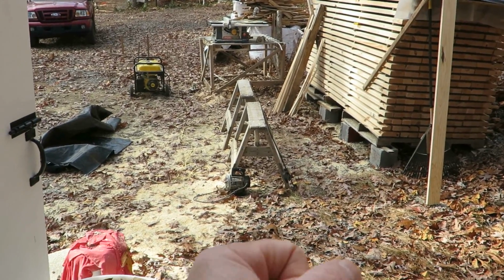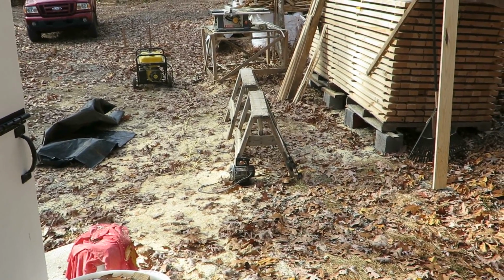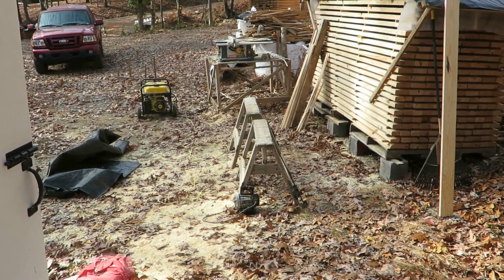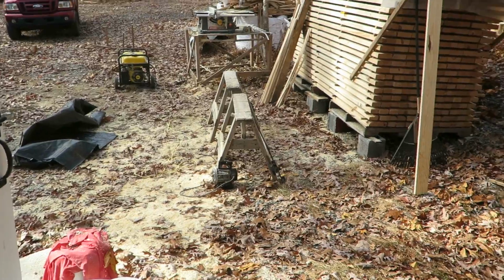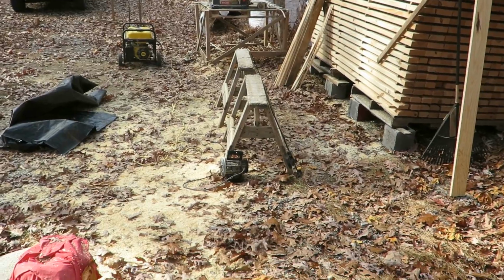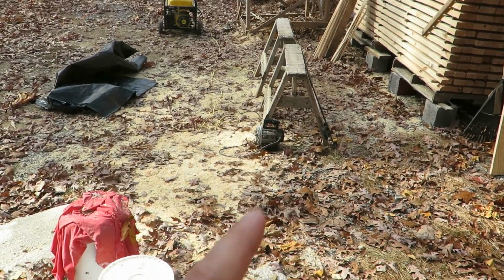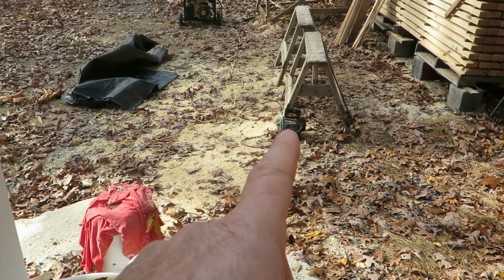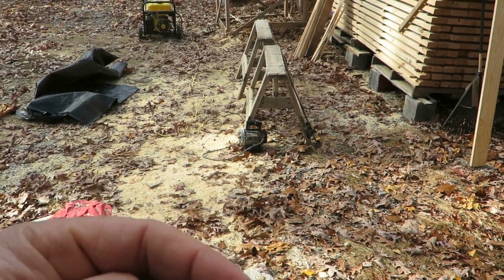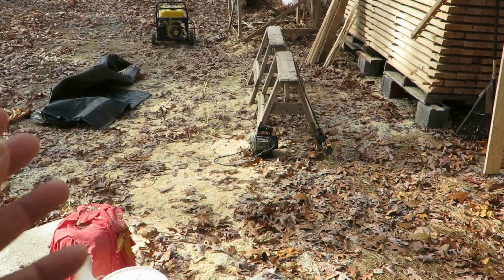But it is always better to run back through the grain backwards, a quick run, because that will take out a bite of a lot of your wood, so it won't splinter out. I don't know exactly the term for it, but it's chewing so much out at one time that it splits your wood. So that's why with that particular 1/4 inch cut, because it's taking so much wood out at once, what I do is I run backwards on the piece a couple times, and that will keep it from splintering my wood.